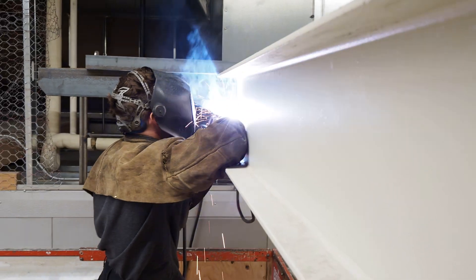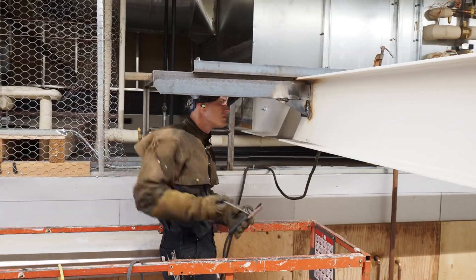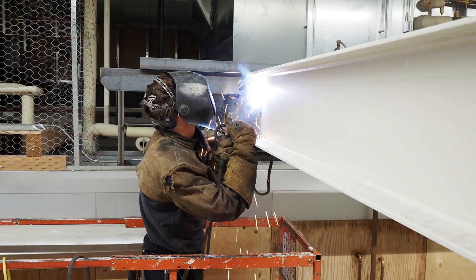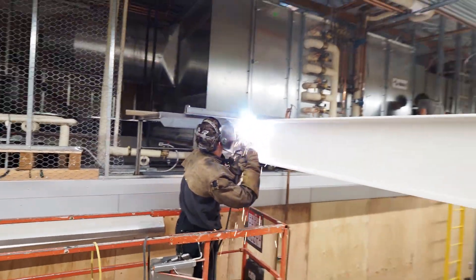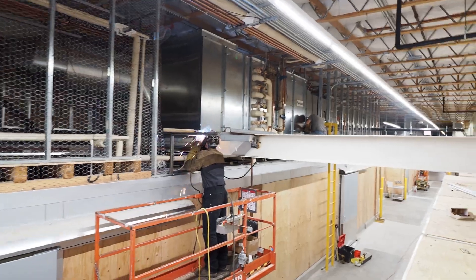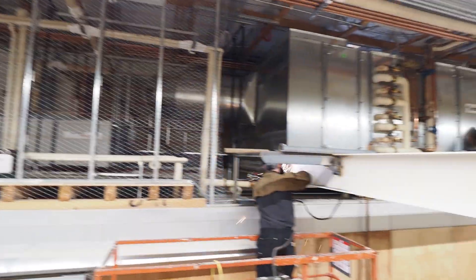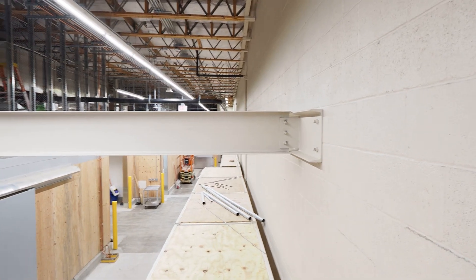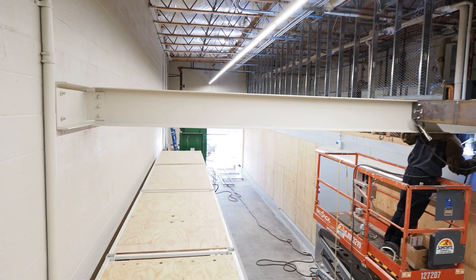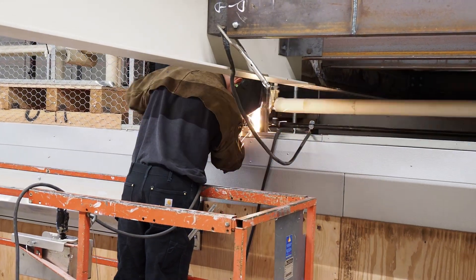Here I am tacking and welding — actually here I'm welding; it looks like it's already been tacked up. I'm still going to only spot weld since this is a catwalk. It isn't a load-bearing structural weld. I'm using a 6011 or 6010 rod — it doesn't matter which one. 7018 is not technically needed for this kind of work. Too much over-welding and too much heat weakens the metal in the welds all around the area. Thus over-welding is just as bad as under-welding — you have to find that happy medium.